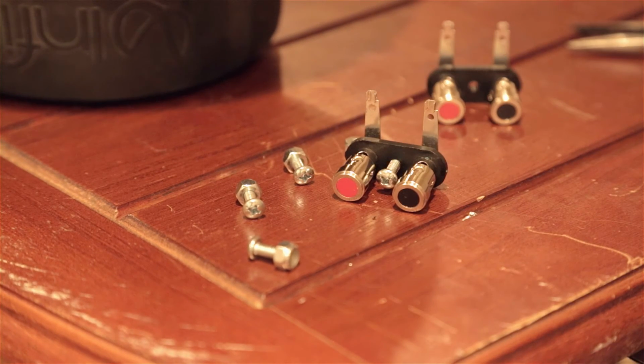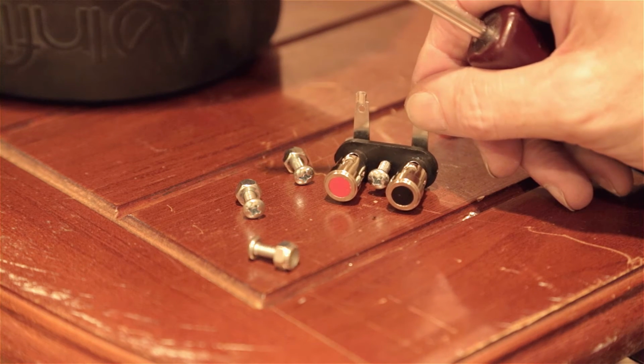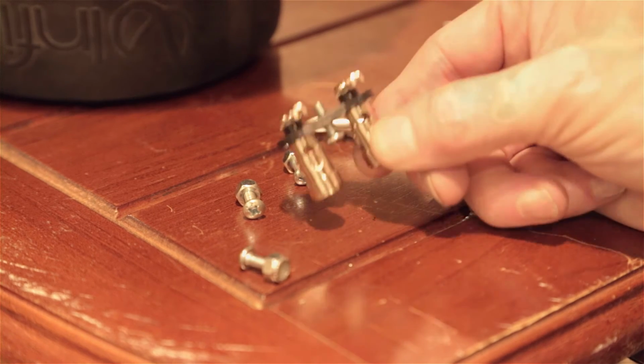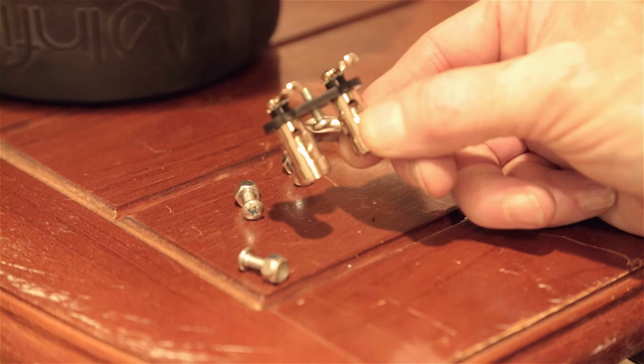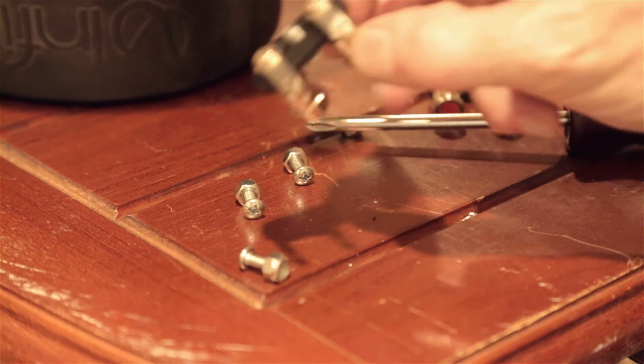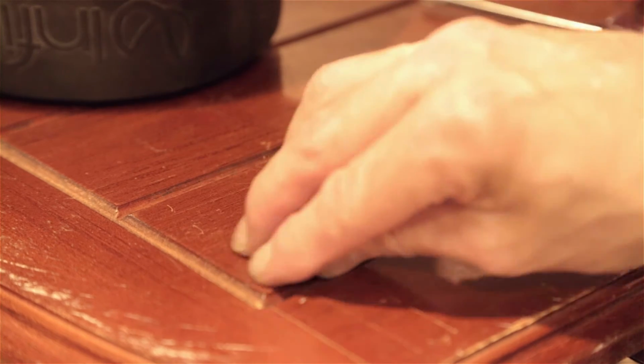The hole I drilled doesn't quite give clearance for that screw, but I can crank that screw in. Since the material is made of plastic, I can easily crank the screw in. That will hold that screw in place pretty well, and that actually would be preferable. So we'll put in, cranking that screw in, and it kind of stays in place. Now the only other question is whether the hole in our plate in the speaker is large enough. If not, we have to enlarge that hole.